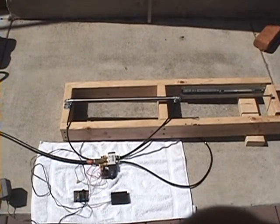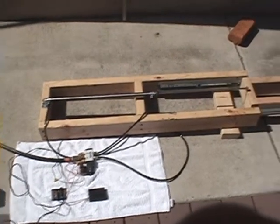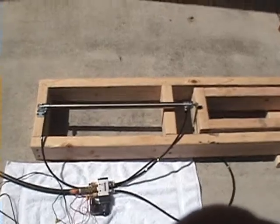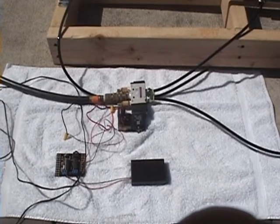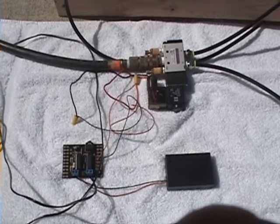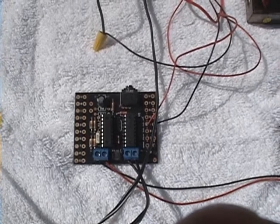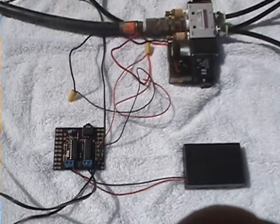Since this isn't going to be hooked up to a compressor, it's going to be hooked up to an air tank. I want to make sure that one filling of the tank will get me through the entire evening. Eventually I'm going to have a 110 solenoid here, triggered off of a wireless push button. But for today, that solenoid is on its way — it's been ordered. I'm using a 12-volt solenoid here, and this is the setup I'd use if I was going to have this triggered by PIR. I'm using a PICAXE 18X board, and I would just connect a PIR onto the left-hand side and change the programming a little bit.